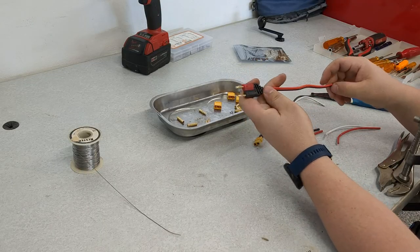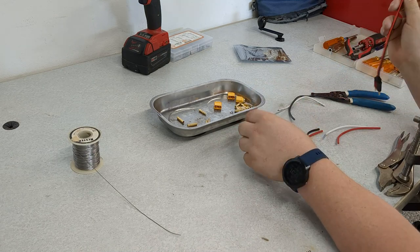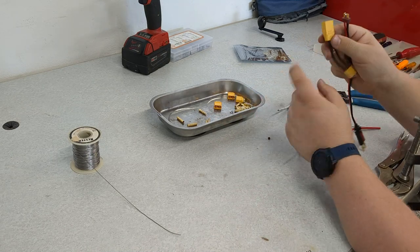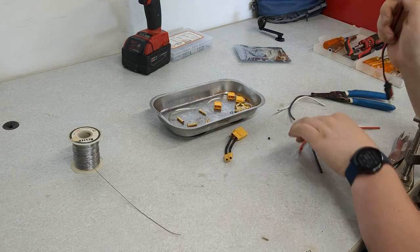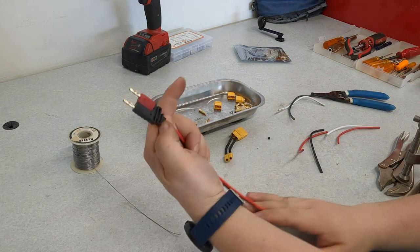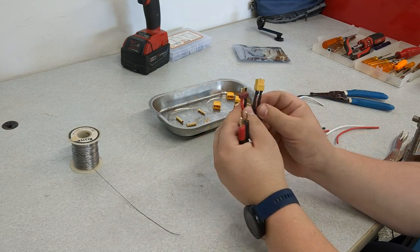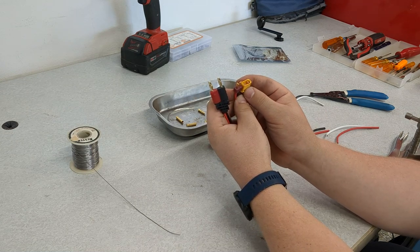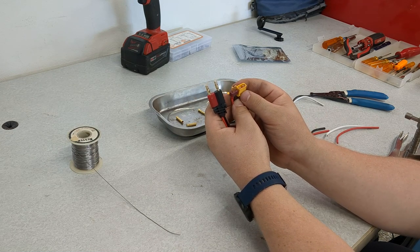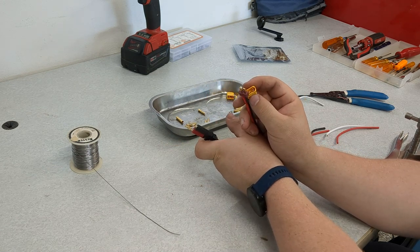The next thing that I need is a set of charge cables or charge leads. Instead of purchasing a bunch of adapters that go from XT90 to XT60, I'm just going to make a set of leads that go from these 4mm barrel connectors to XT60. That way I can charge all of my batteries — I have four of them. If I can get through four batteries at ProLine by the Fire, I will be thoroughly impressed. That's roughly 8 to 10 hours of run time.